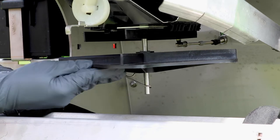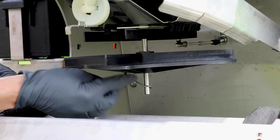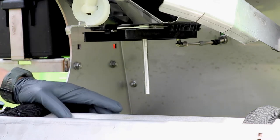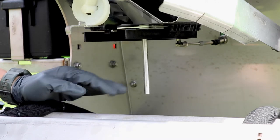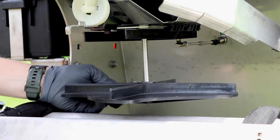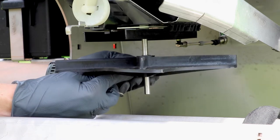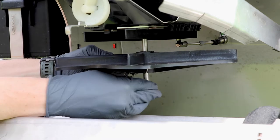To remove the impeller so we can open the hopper door and catch our product, all we need to do is take this removable spinner clip — it's reusable — squeeze up on it, unclip it from the shaft, pull that out, and the impeller will drop right off. Putting it back on is just as easy: get it back on there, spin it till you find the hole in the plastic impeller, start it in, drop it down to see where the hole is, get it back through, then squeeze up on the clip and it locks back around the shaft.